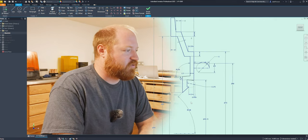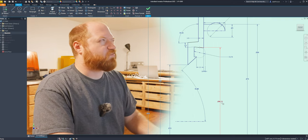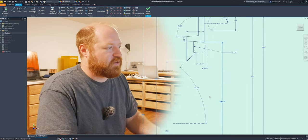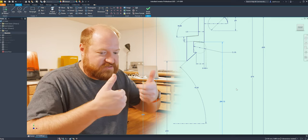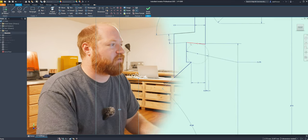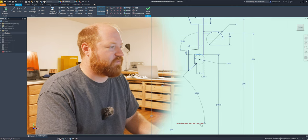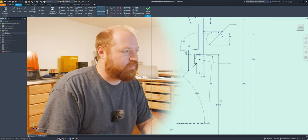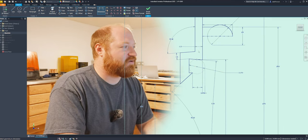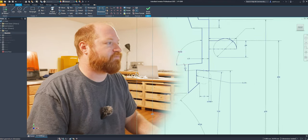I've decided that the o-ring is going to be an OD fit, so the actual o-ring is 1.8 inches in diameter nominally and I've set this dimension to be 1.8, so as you snap the o-ring in it'll kind of expand into its groove. To help keep that set in I'm going to add an angle to this surface in the opposite direction that typical draft would be — 5 degrees. Since I'm 3D printing it it doesn't really matter, but this would not be fun to make in the real world because it has negative draft compared to the pull direction.